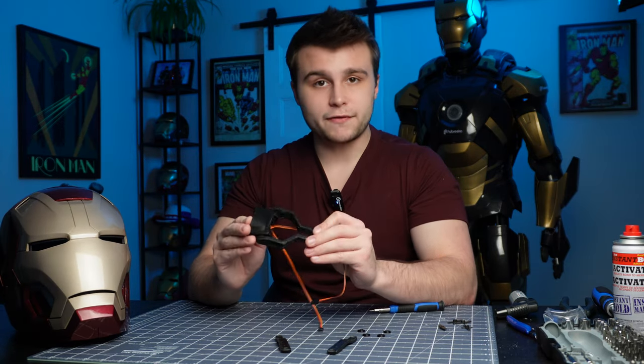Once all the connectors and board have been soldered to the PCB, all I need to do is crimp some connectors and plug them in. I have one wire for power, one for the switch, one for the eyes, and two little connectors leading to JR connectors for the servos. There are two things we need to test to make sure everything is working. The first is finding the closed position of the servo arm - right now I have no idea what position my servos are in, so there's a good chance the servo arms won't be aligned. To find the closed position, unscrew the servo arms from the servos, set everything up, and turn it on as if using the helmet. Once the eyes light up, that means the faceplate is in its closed position, and the servos are in their closed position. Then just take the servo arms and screw them back into the servos - now they're correctly aligned.